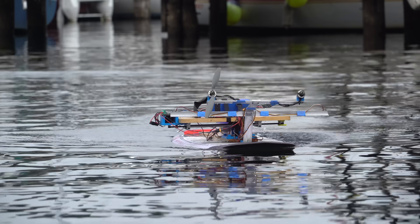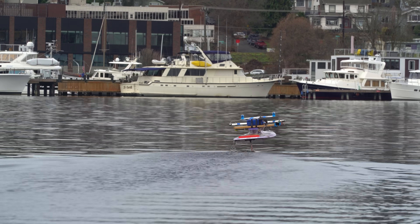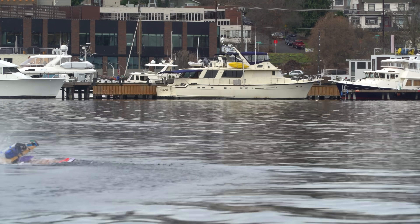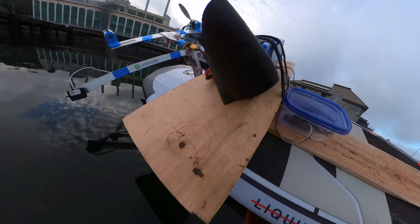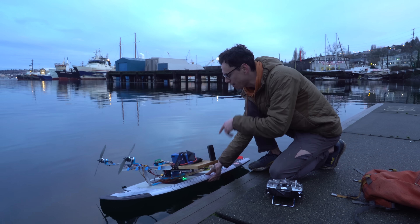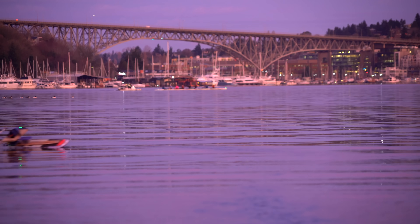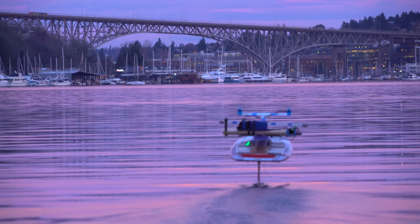Shifting the weight from side to side definitely seems to have some effect on the board, so we're off to a good start. However, once the board was up on foil, the roll control didn't really seem all that much better than before. I increased the proportional gain to make the slider move more with less control input, but that also didn't help much. There was a sneaky setting on the O-Drive limiting max current during initial setup, and after turning that off I got the full 10 amps of phase current — plenty of torque to slide the battery around. That helped a little bit and my flight times were getting longer, but there was still just not enough roll control. I think the weight shift idea totally could work with a longer slider or more weight, but I felt like there was a simpler way to make this work.